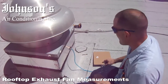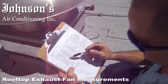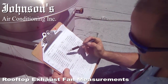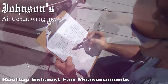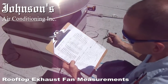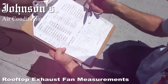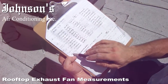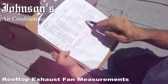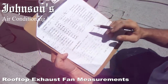So how many of the fans have you done on this roof? I've troubleshot every one of them — why they're not running, stuff like that. The ones with all the notes on it and your CFM readings have been read with pressure. The ones that are blank, I troubleshot and made notes for myself exactly what I did, what kind of parts to repair them — and mostly motors.